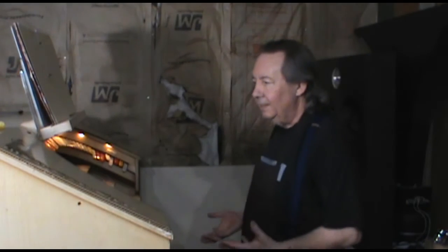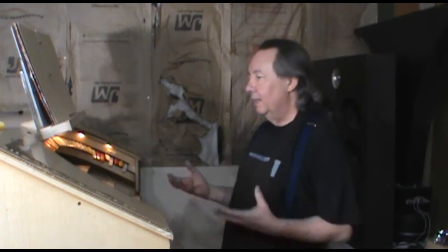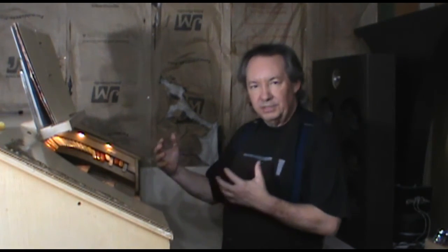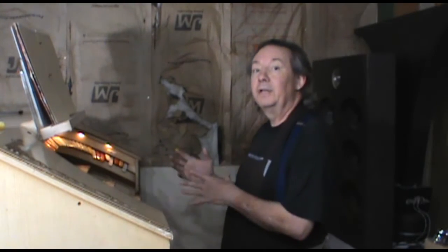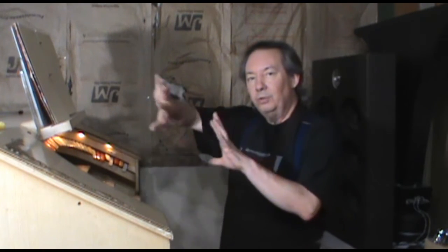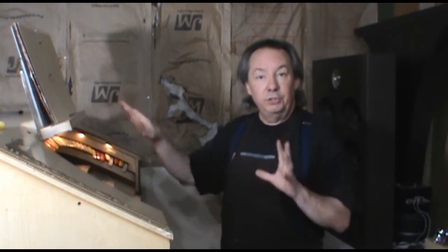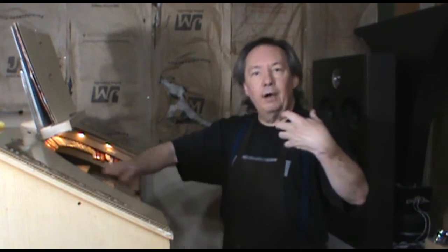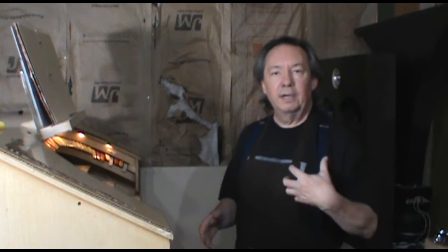There's other things that are kind of behaving quirky, such as the percussion sounds and the channel seem to be kind of phasing in and out, and like I talked about before, bypassing that accessory panel, because that's a whole bunch of stuff that I'm not going to be using. And why invite one more problem on a 50-year-old item? So that involves taking the plug out of the output panel and then putting in jumper wires so that the signal comes from the expression module and then goes straight out into the output module.